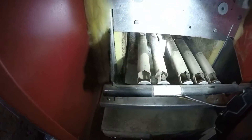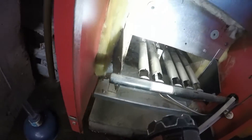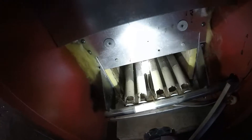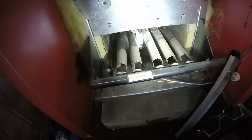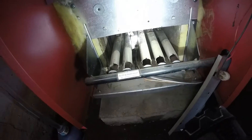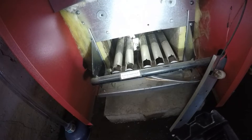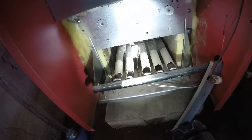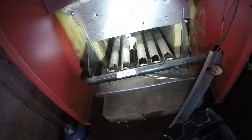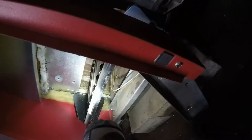There's the pilot. It looks like there's a little bit more corrosion and buildup in here than there ought to be, so I wonder if this is our opportunity to clean this up a little bit. I'd be willing to bet that thermocouple has got a lot of junk on it and it's not conducting the current signal that typically goes back to the gas valve to confirm the pilot is still on. There's probably enough garbage on it that it's just not being efficient.